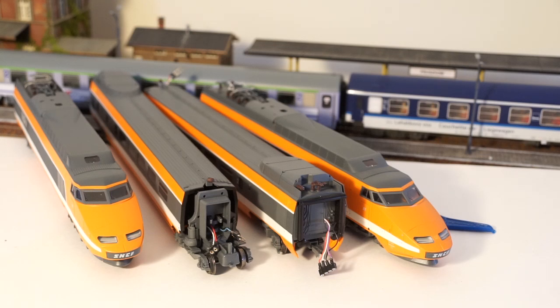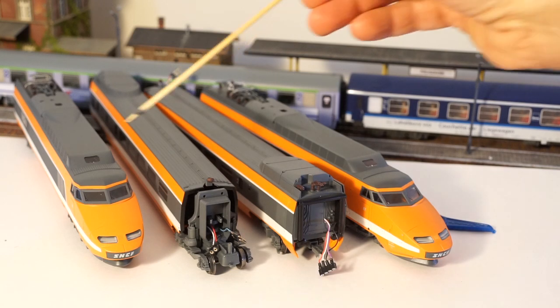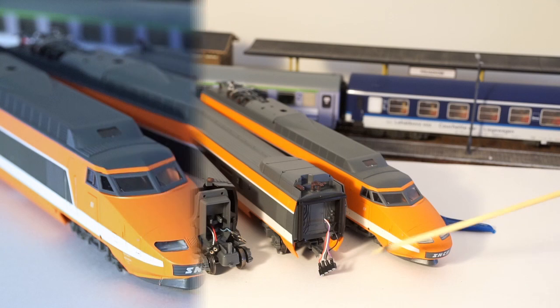And in my case, what I also did is I ran two speakers. I have one speaker in each unit. And that's the reason why you see four wires coming out of the end of transition points. This train is set up with two locomotives, push and pull, and so I wanted to have speakers available in both of the units. And once you add some additional cars and space them more, the effect is actually fantastic. If you have the patience and the skills, I highly recommend installing the second speaker in the second unit. It's almost like a semi-stereophonic effect of hearing electrical motors and air compressors on both ends of the train. And then the second set of wires is interior lights. So everything is controlled from the main decoder, from the powered unit, through a 4-pin connector.